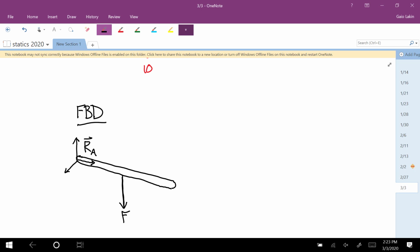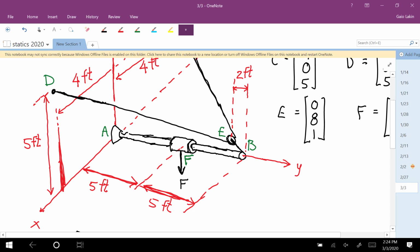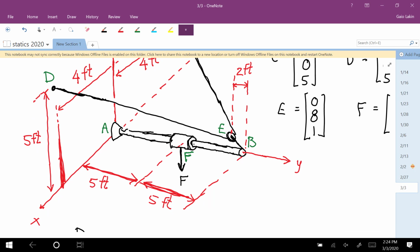Okay, now I want to be a little careful. Have I got everything on it? So we dealt with the weight, which was ignored. The only other place the surroundings makes contact with the boundary is this little cable touching the end. But for what it asks for, let's see, does it say? Calculate the reactions. Well, I guess that means we want to know the tension in this big cable and the tension in this little cable.